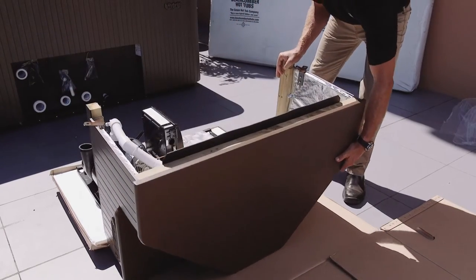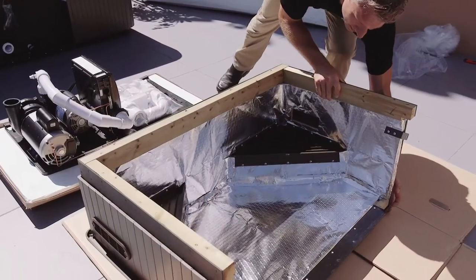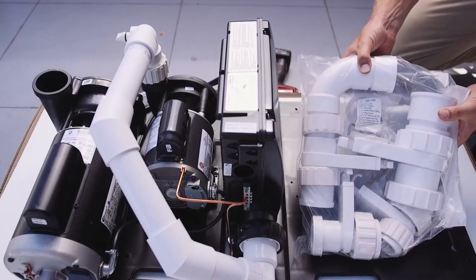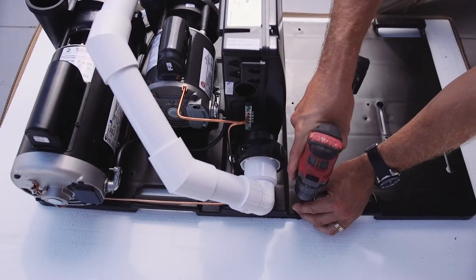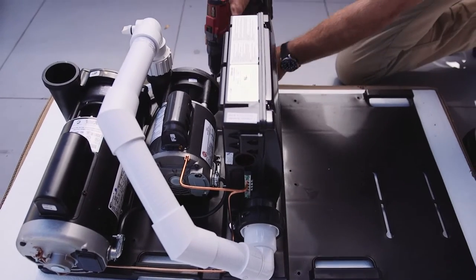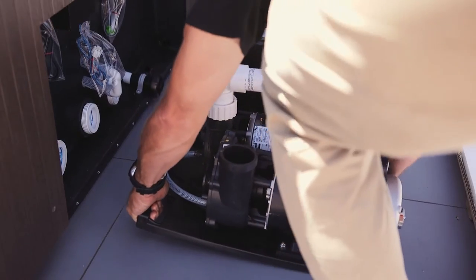Pull away your Safe Access step — and here's your Energy Saver management system. Your plumbing components, gaskets, O-rings, a hex key, and bolts are all in this one bag. First, using a number three Phillips screwdriver, remove the screws from the base. There are two screws, one in the front and one in the back. Then take the management system off the box bottom and move it closer to the hot tub. This is the front.